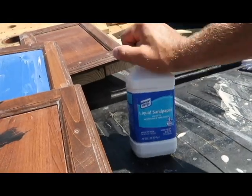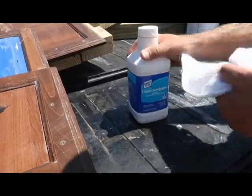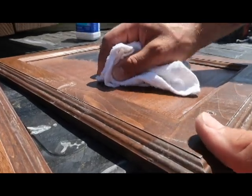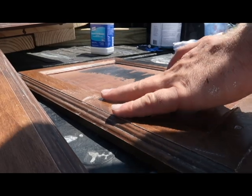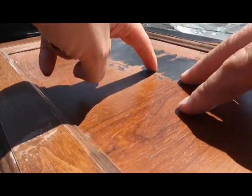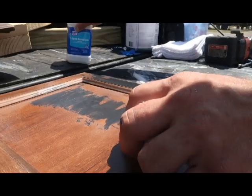So while we were renovating, we heard about liquid sandpaper from a YouTube video and figured we'd go ahead and try it out. It works pretty well. Shake it pretty good, get a rag that you don't mind trashing afterwards, and saturate it with the liquid sandpaper, then just go to town and wipe off everything. Circular motions, press down with pretty good pressure. You're not going to see paint come off — it's just to get the lacquer coat, the clear coat on top of the wood that you're about to paint off. That way when you go to put paint on your wood, it actually sticks instead of flaking off, because the clear coat won't allow the paint to stick to it. The liquid sandpaper just takes that top coat off and allows you to apply primer and paint without having to worry about it flaking.